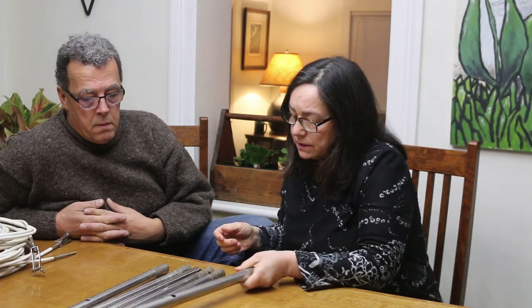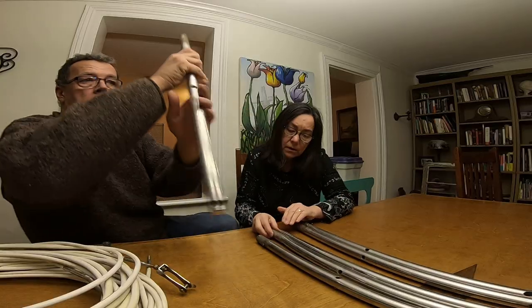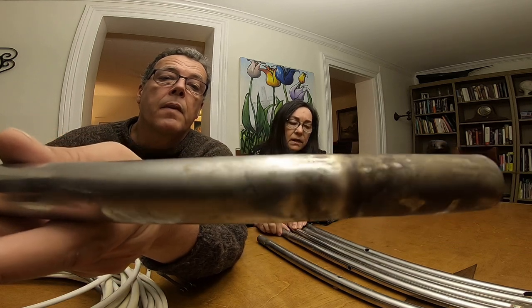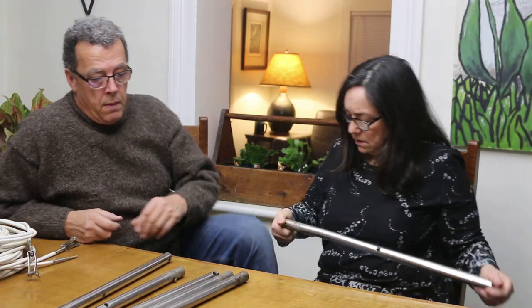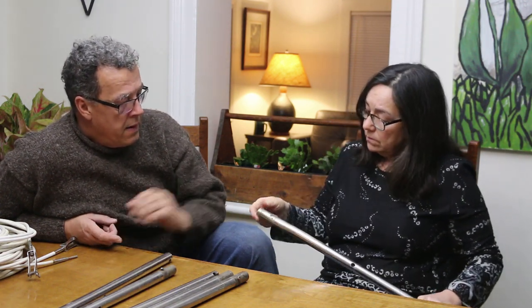in the stanchions. We have one here that we could see. Yeah, this one's quite bad here. Oh, yeah. I'll just put it in front of this one's bad too. So you can see that they've obviously hit something with the boat, and the stanchions have been bent and then straightened again. But they've cracked. Yeah. They probably didn't heat them up before. If they would have heated them up, it probably wouldn't have cracked, eh? Unless maybe they cracked when they... I think they bent over and someone has bent them back again.